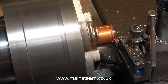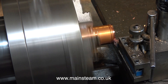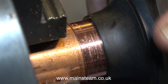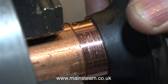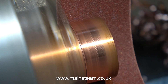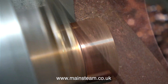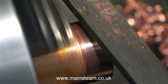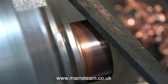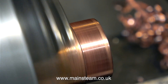Copper is not good stuff to machine — it's not very good to drill either, because it rags up and picks up and messes up very easily. But if both the speed and feed are correct, you will get a fairly good finish, but you do need some lubrication. I've left the piece of copper tubing turned slightly oversize and now I'm using some emery cloth to reduce it slightly so that it's a tight fit but not too tight a fit in the main housing. I'm using a file with a handle to remove the sharp edges and burrs from the outside diameter of the copper.